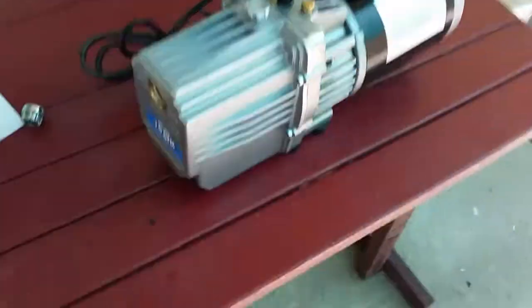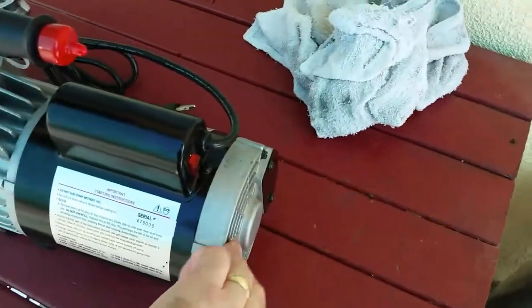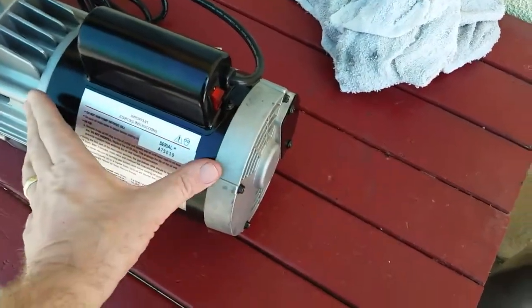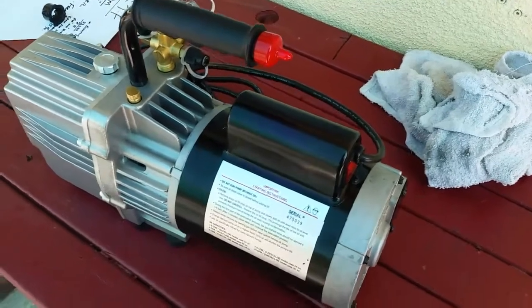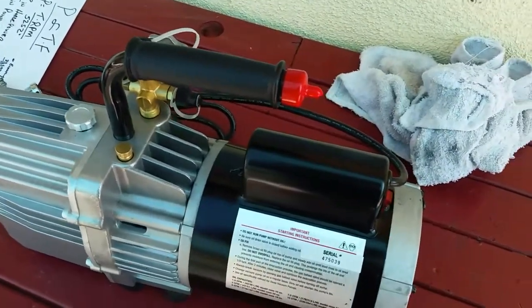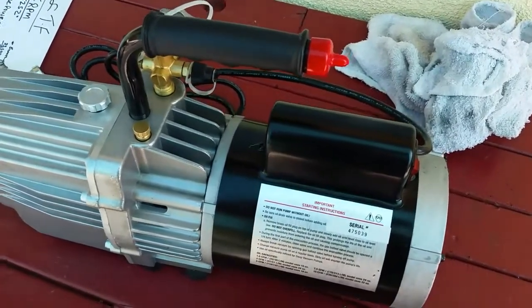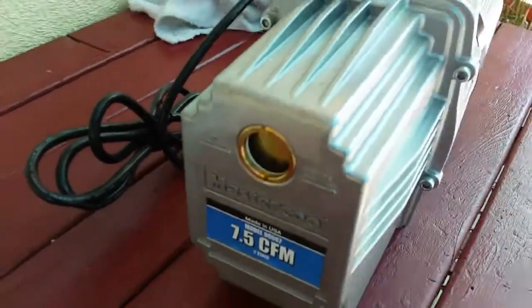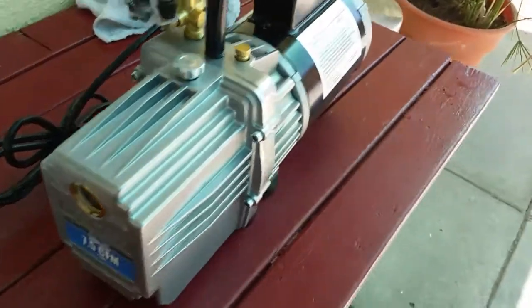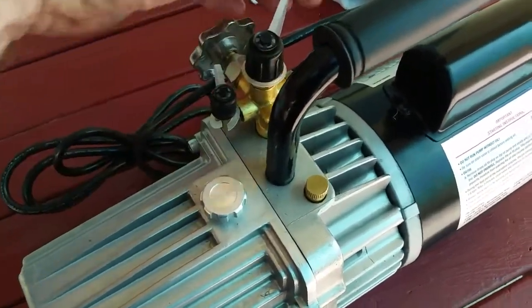Okay, fully assembled, coupling installed, with 10-32 screws along, 6 inches long or so. They're installed. Unit's ready for testing. So we're going to get the vacuum gauge and also the extension cord to power this thing, and we'll just see. I'll let it run for a while, and it's got fresh vacuum pump oil in it, plenty full. It's ready to go. And what my vacuum gauge will be is on the, there's 3 size connections here.